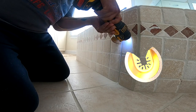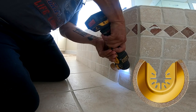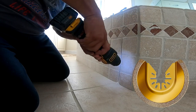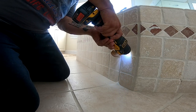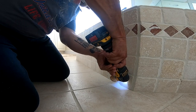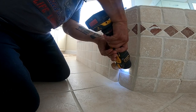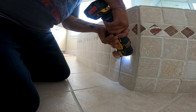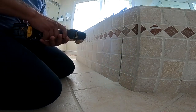What I'm using here is a Rockler grout removal bit for my oscillating tool. These are about $24–$25 a piece but they are well worth the money. This will cut a groove right through the grout with a lot of ease — it's a heck of a lot easier than using a hand-held grout removal tool where you scrape and saw it out. This works like a charm and it quickly sinks right through the grout to the drywall behind it and will even cut the drywall that the tiles are affixed to.